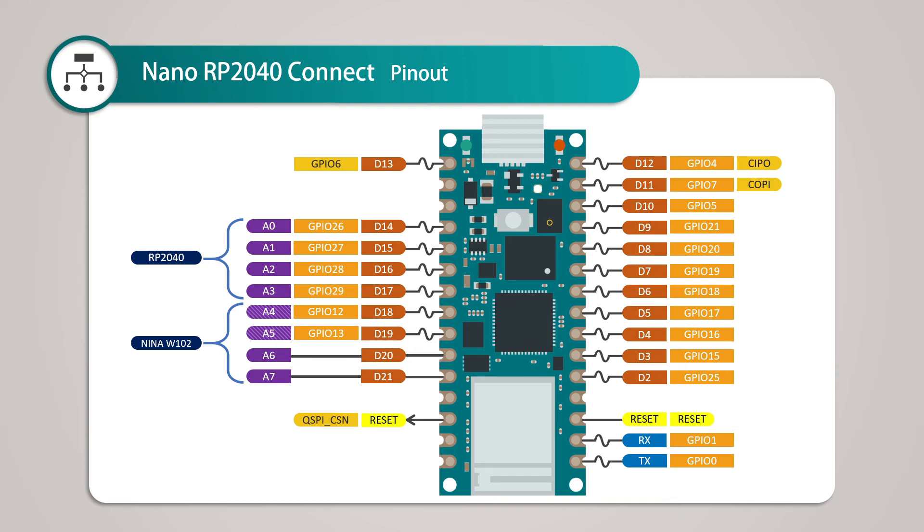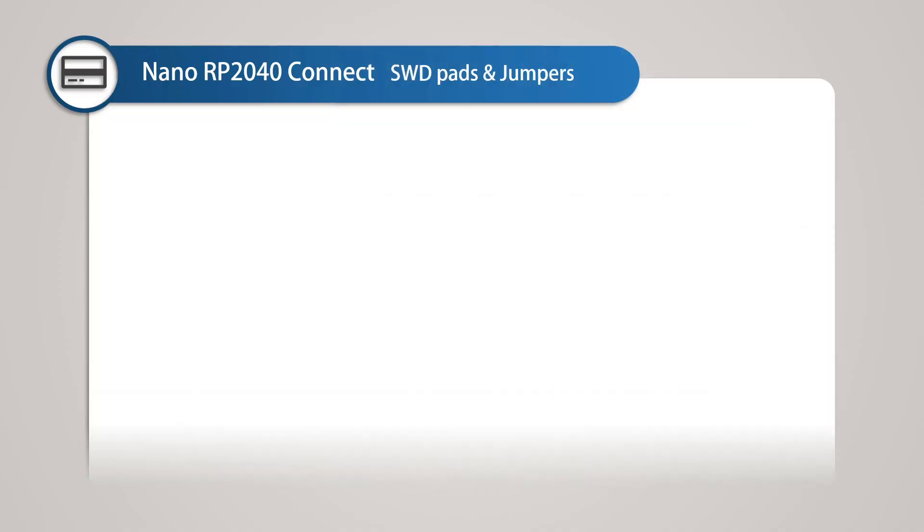When the board is powered through the micro USB port, this voltage is reflected at the VIN pin as well. The acceptable input voltage range is 5 to 21 volts, and a DC-to-DC buck converter converts this to a stable 3.3 volts for the RP2040. The 3V3 pin gives a constant 3.3 volts that can be used to power sensors and other devices. The 5V pin is internally connected to the micro USB port voltage pin, so make sure you are using a stable 5 volt supply at the USB port input. To get output from this pin, the VBUS bridge on the back of the board must be soldered. There are two ground pins available on this development board.